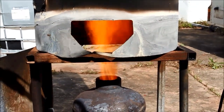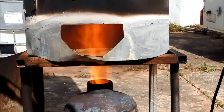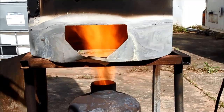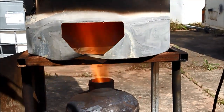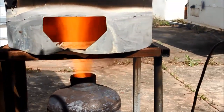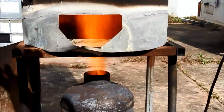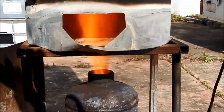That's a little tip for those of you interested in running these things. You can see now it's getting a little bit too much fuel and it's starting to smoke again — so that's the whole gamut of what to look for. As you can see, it's a very large flame when it's smoking too rich, versus the small flame when it was smoking too lean.